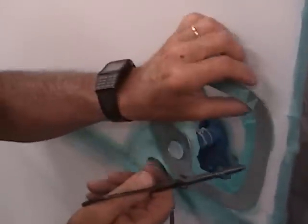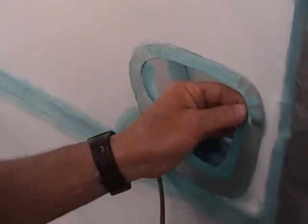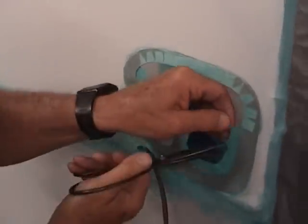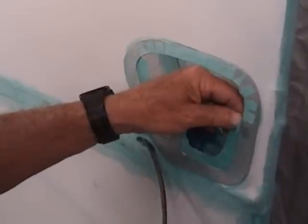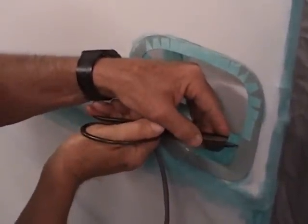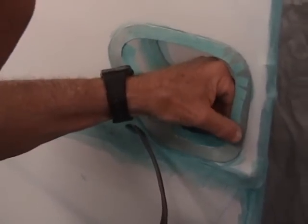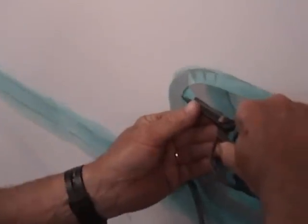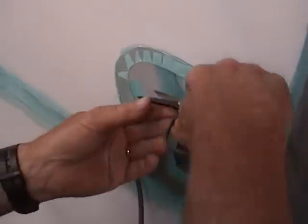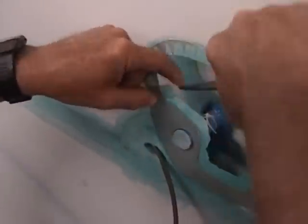We're going to come back and show the little doily that goes over this to finish the piece off and make a real nice looking finished product out of it. The nice part of this is that being aluminum, when we drill the mounting holes for our cover plate, we'll use number 4 PK screws with a number 44 or 45 drill bit — that works real nice. When you put the screw in there, it cuts a set of threads. During annuals, if you get it started in the same set of threads that are already cut, that's going to last for years. I've got covers like this that have been on projects for over 20 years with the same screws still in the original holes. That's a real plus for this aluminum fixture versus the plastic.